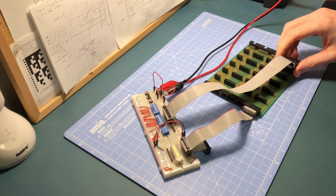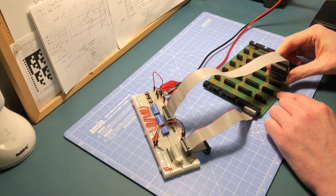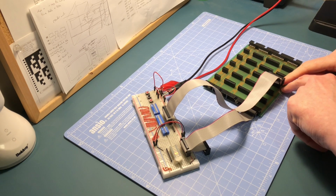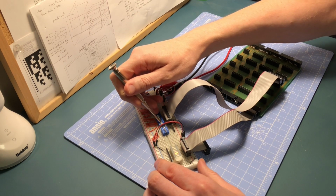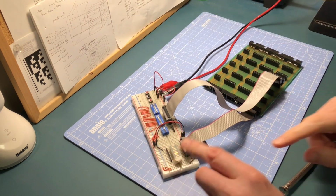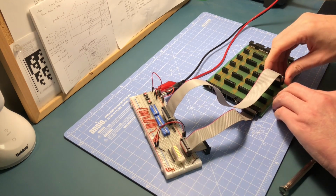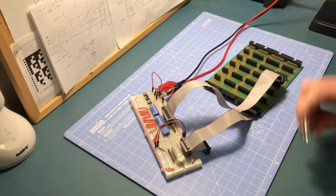Now the one other thing I need to test for is, well actually, if I put this into the wrong socket, do I get any lights? And actually I do get one light, which basically means that one of these lines is cross-talking to the other, and I think it's number 2. Yes, number 2 is going to number 3, and what I would expect is that if I transfer this back to the side, so I get all lights, and if I go to the other socket on here, it would be number 2 that will come out, which makes sense.